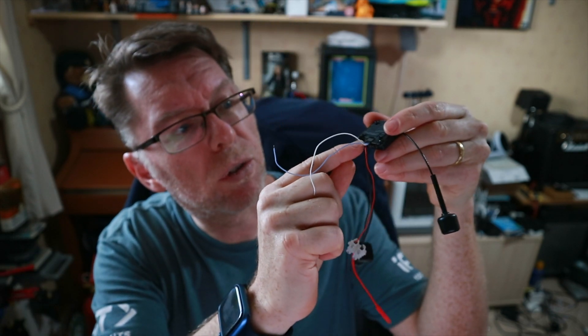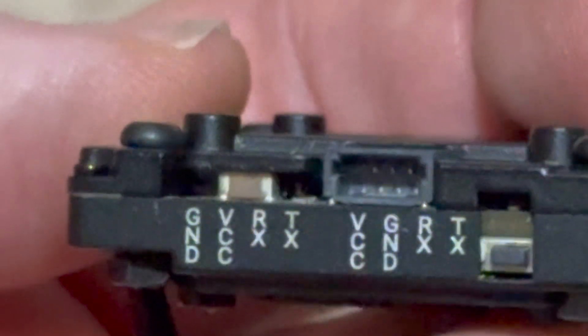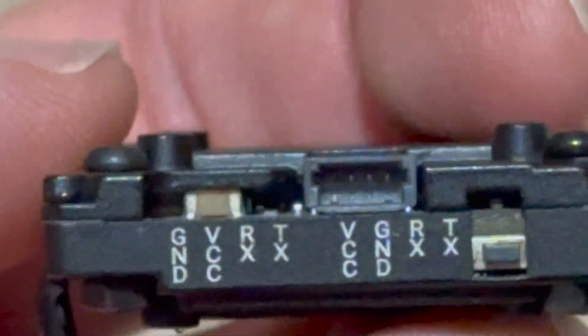This is actually the one with the basic V2 camera, not the pro camera. I thought I'd take it apart and see what I can do - I had a slight suspicion about this connector here. I thought I'd try soldering directly on there. But whilst I had the top off and was about to do it, I thought maybe I should test with a multimeter first. When I looked at the pins I noticed the VCC pin wasn't where it should have been - it looked like the plug had been plugged in and the pin wasn't quite aligned, so it folded into the side and obviously wasn't connecting. That's why it wasn't powering on. With a pair of tweezers I very gently tweezed that out, straightened the pin, plugged it back in and it's back to normal.